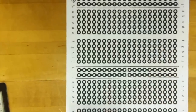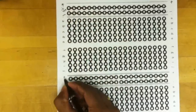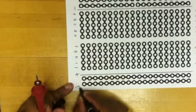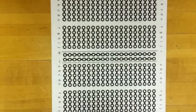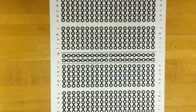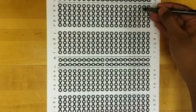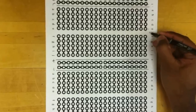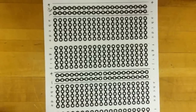As you can see from this schematic, we have a positive and negative here, a positive and a negative here, and a positive and a negative here. So we use this region of the breadboard to connect the power source to our circuits. All these vertical lines are common connections, and there is no connection between one side and the other. So we use vertical common connections to connect chips.